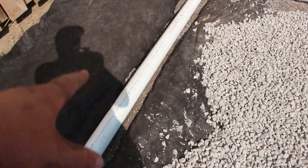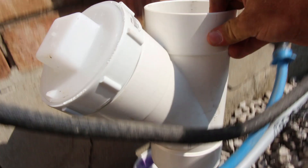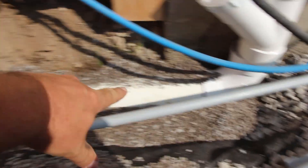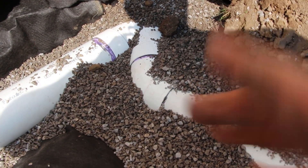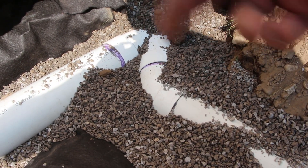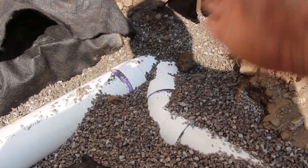With our perforated four-inch PVC pipe, holes down, we've got an end cap adhered on there, an elbow, and a clean-out. We've lined that up nicely to our downspout. Running along the foundation we always use solid pipe — could have done perforated, but I like getting the downspout water away quickly. Then we've got a Y connection here. It's always better to have a Y than a 90 so the water flows nicely — a 90 causes a whirlpool effect and adds friction, whereas a Y lets it continuously follow the flow.